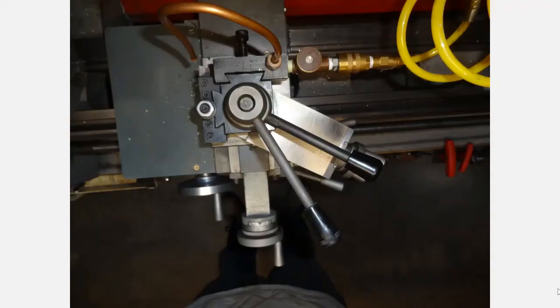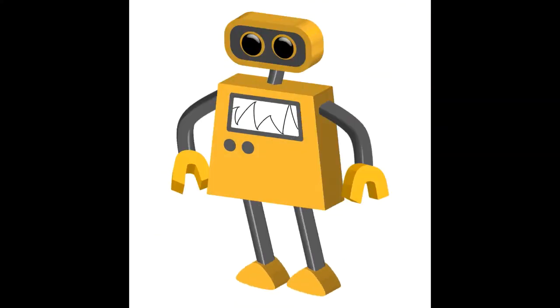You will have to drill the appropriate holes for your air connections depending on your shutoff valve — whatever size thread it is, drill the appropriate hole. Also, your tubing connection here — whatever size thread it has going in — will have to be tapped for the appropriate size, and as long as it goes down far enough to enter into the hole you made, it's going to work just fine. If you'd like to be notified of other new modifications, please click the subscribe button. Thanks for watching.